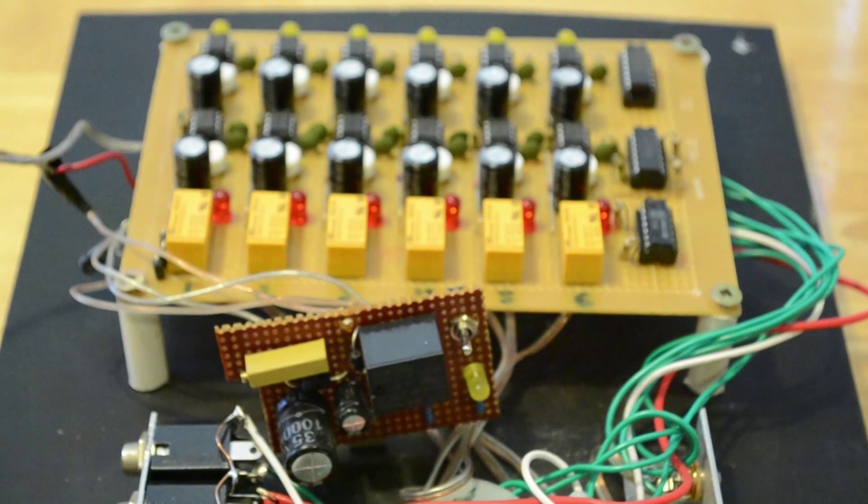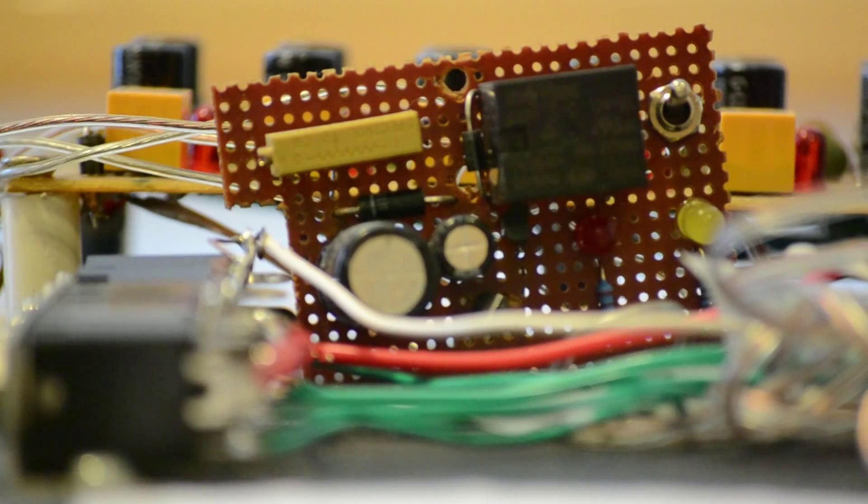And that's it. Oh, that's awesome — I think I'm going to make another one of those. Of course it'll work. Here's one built exactly like the diagram — it's in our hot controller. The only difference is we put a couple of LEDs on: one to show when the power's on, and the other to show when the circuit's actually firing, just as a visual cue. So one light comes on as soon as I apply the power. Now the circuit's slowly charging. And the other light comes on and the circuit actually fires.